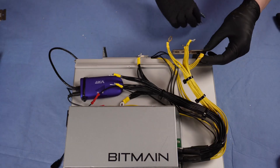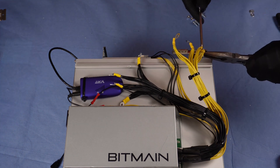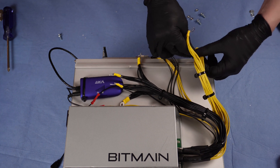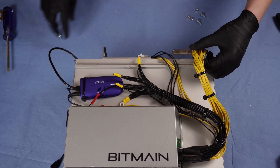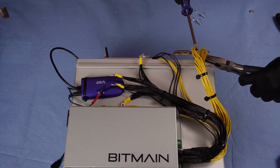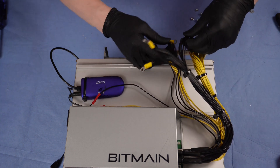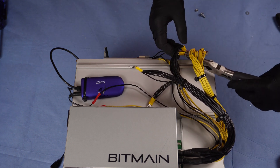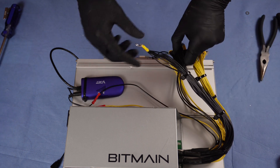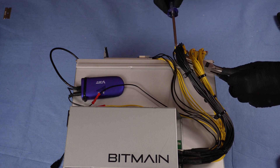Next up was to connect my wiring harness to the bus bars. I connected the four spade connectors to the bus bars using number 8 screws, attaching one connector to each side of the two bus bar holes — I did this for both positive and negative connections. When attaching any of these power connections, I made sure to make these as tight as I could. They can wiggle loose over time, and a loose connector might cause more power to flow through the other wires, which could cause wire overheating. This is why using a single large copper connector is really a better approach here.